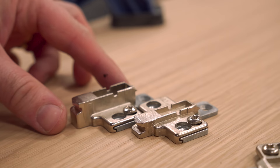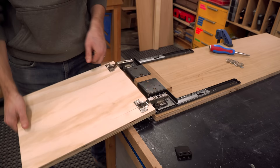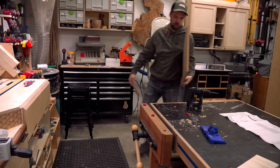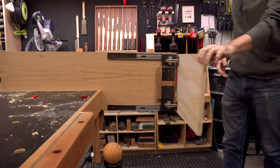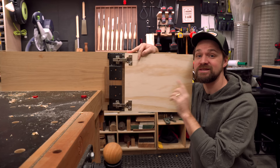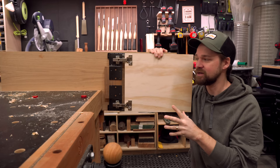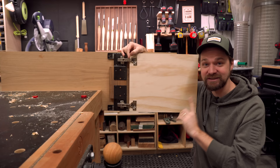My solution was to add in some spacer clips - this just adjusts the door outward. I was originally planning on having a full overlay door but it didn't seem to be possible with the hardware I was using. When I clipped in some spacer clips, these full overlay hinges basically turned into inset hinges and they worked fine. I'm really glad I made this mock-up because I now understand this hardware a lot better. One of the things the instruction manual says is that you can use partial overlay hinges, but when I use those hinges they scrape up the front of the door. So I'm going to be using inset hinges, which means I can use a trim strip to cover up whatever exposed edge there is - that just prevents the door from getting dinged up. I think I can go with this solution and we can move on with the project.